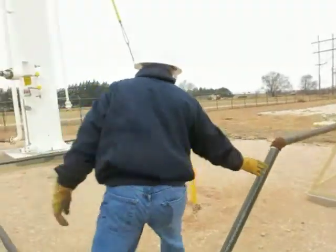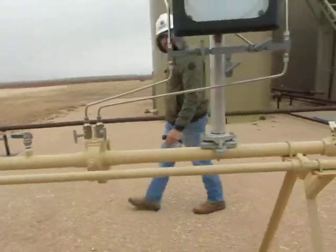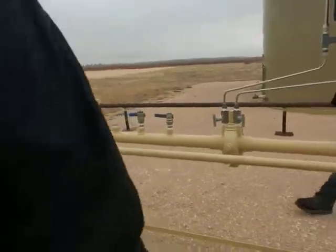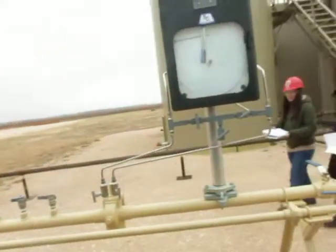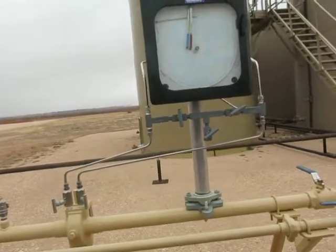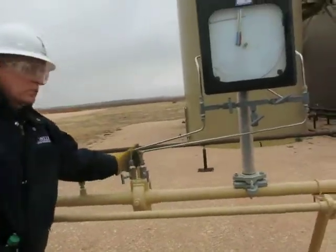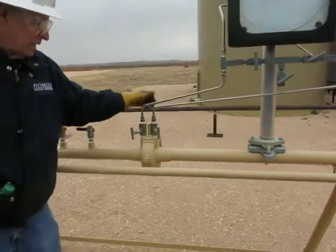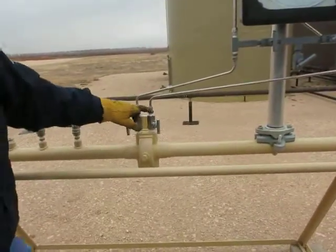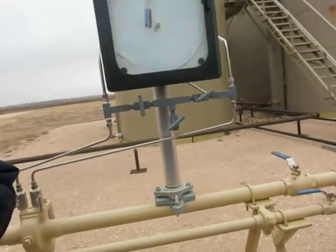Okay, so let's take the sales all the way through the gas meter. Have we talked about orifice meters yet? I think we did in 4303, right? So the orifice plate sits right here, and as the gas flows across it, we record the pressure upstream and downstream. We get a differential pressure, in terms of inches of water. The orifice plate just has that small hole in it.